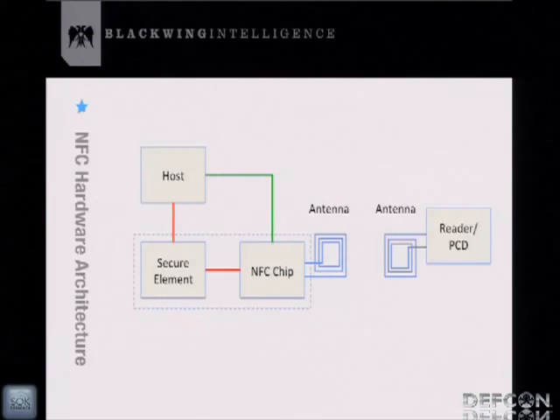Here's the NFC architecture conceptually. You have the host — the Android phone OS and hardware. Google Wallet communicates with the secure element, which encrypts your account information, and the secure element communicates directly with the credit card reader without the host ever seeing the credit card info. What Doug's code does is follow a different path using the host controller interface to communicate directly with the NFC chip and the reader, allowing us to capture the entire byte-level transaction between an NFC phone and a reader.